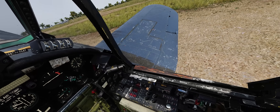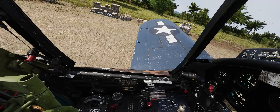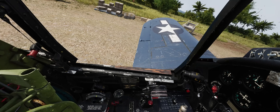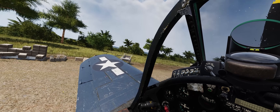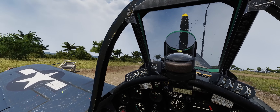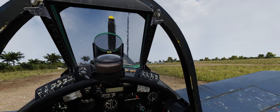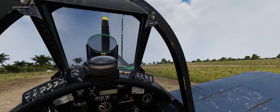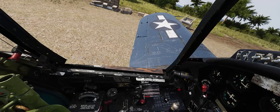However, this is not true of the wing folding mechanism on the left side of the cockpit — you always want to have that forward in the spread position. I guess the reason why I thought it should also be in the neutral position is something that my grandfather had told me about the hydraulic system of the Corsair a long time ago. So after reading about the arrestor hook and its isolation valve and the ability to limit potential hydraulic system battle damage, I kind of thought the same thing applied to the wing fold mechanism.